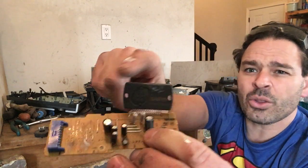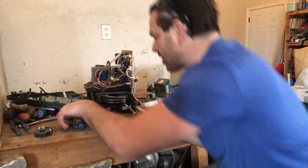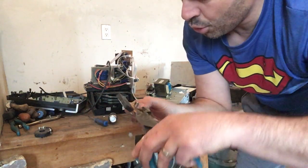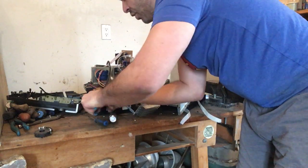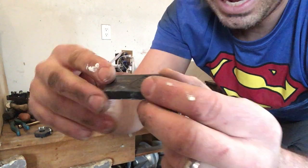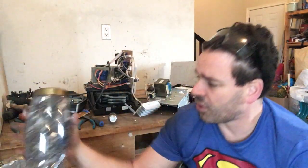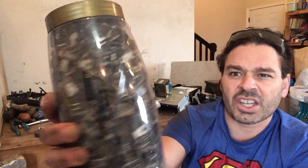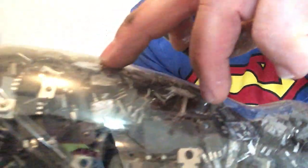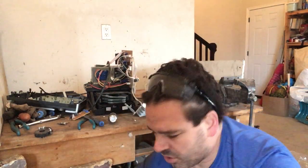This is one of the good items that you will see — even though it looks like plastic, any type of aluminum heat sink will have a type of black connector. And the reason this is special is because this connector actually has number 2 copper inside of it. So all of your aluminum heat sinks do have these little connectors, and they definitely will add up. If I hit this with a hammer, it is going to have a little bit of copper in here. These are all those connectors — all of them are number 2. You can see different sizes, but all of this is number 2 copper, and these are going to give me $4.43 a pound. I actually have nine and a half pounds in here.